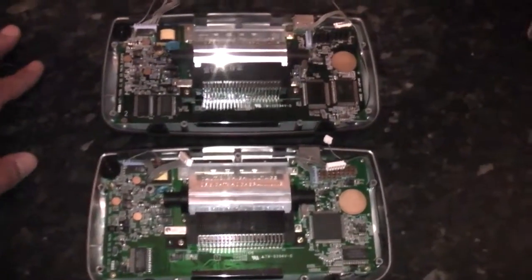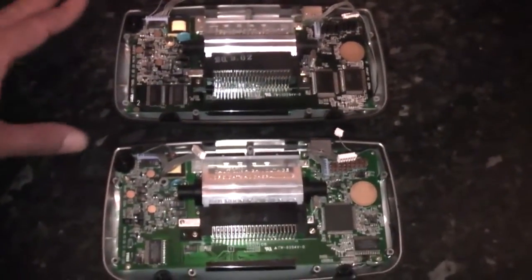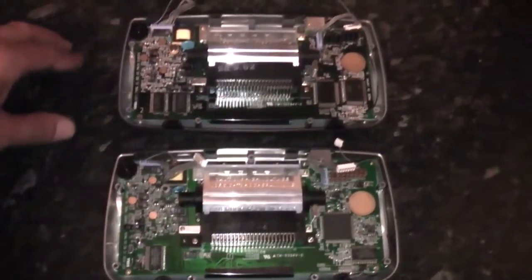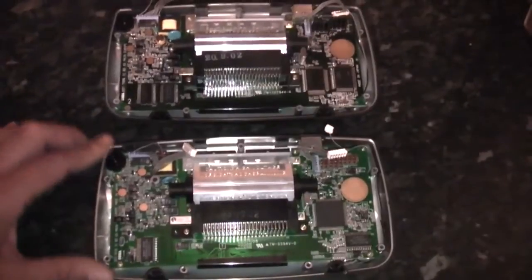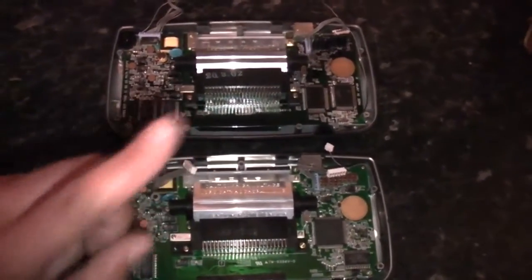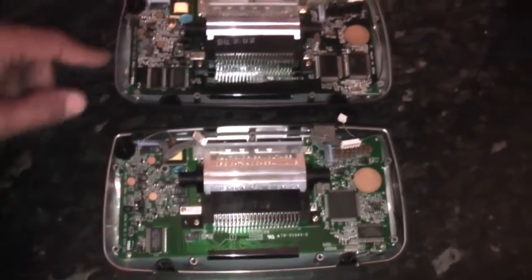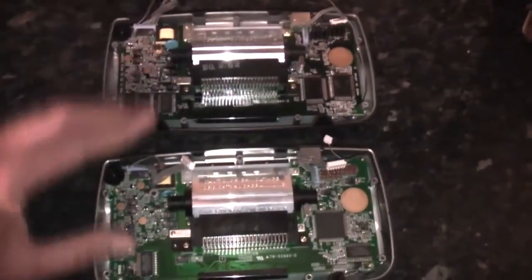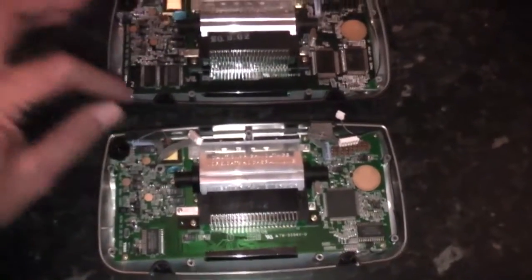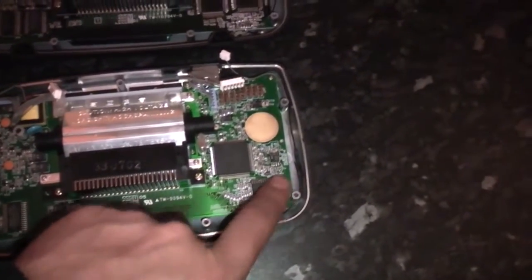This is a follow-up video to go along with my Game Gear tutorials for replacing the capacitors. There are two different types of motherboard: a version 1 and a version 2. The version 2 has one extra capacitor over the version 1, but all the capacitor values are identical for both revisions. They're just in slightly different positions, and the model 2 has one extra capacitor.